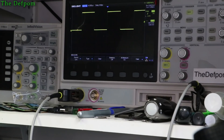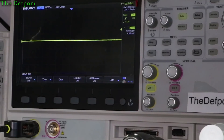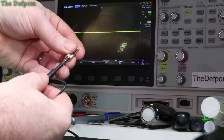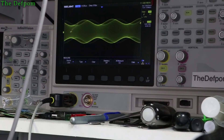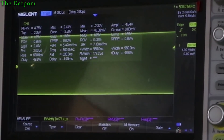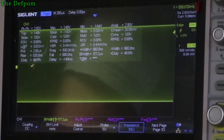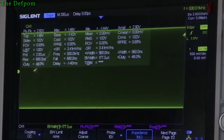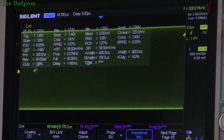I should do a frequency measurement test on this and see what it can go up to. Let's plug the probe directly into the input of my oscilloscope generator and have a look. I'll just plug in there, so now it's got a BNC type connector on there. Just plug into my signal generator — 0.5 volts, no modulation. Let's do one megahertz. We're on times 10. We'll just measure the effective bandwidth — so that's one megahertz and we're getting one volt RMS right there. Let's go 10 megahertz — still one volt.